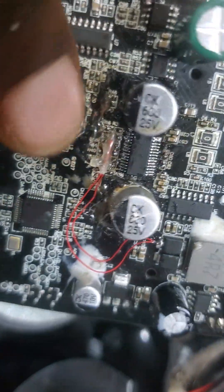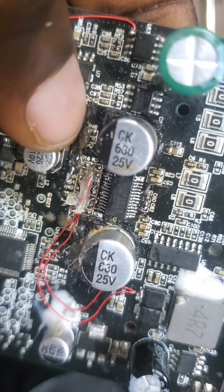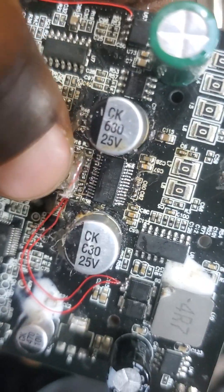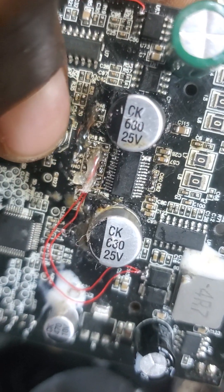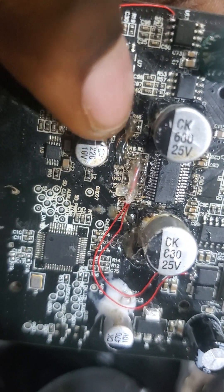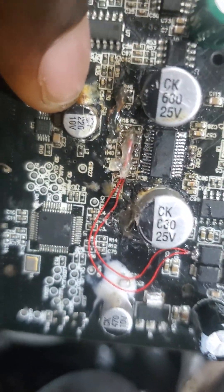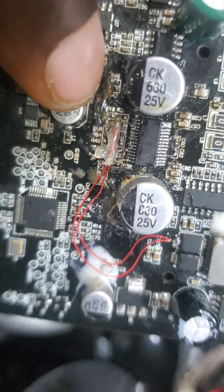There are also missing grounds here — the grounds I've caught. I've applied an insulator on it, that's why it's bulging. That's what I soldered on it — it will not get removed, so it holds it down. It's similar to this whitish insulator here. There are about five grounds missing. So I created another ground — I made a jump in order to create the ground.